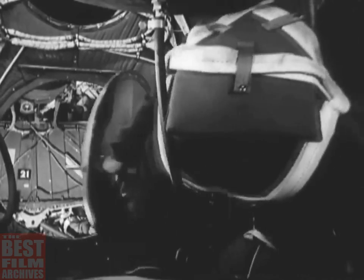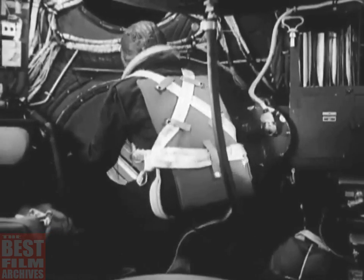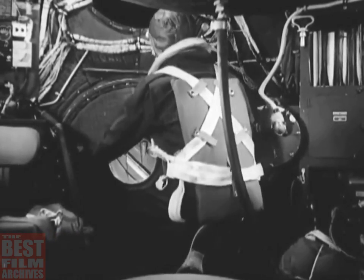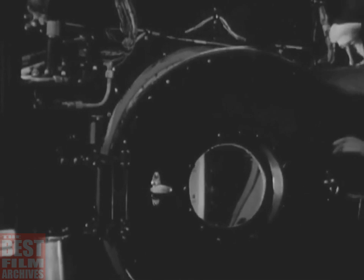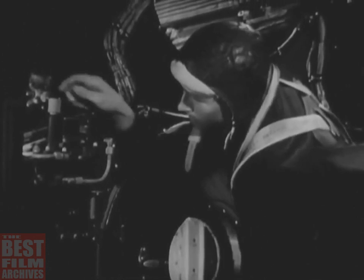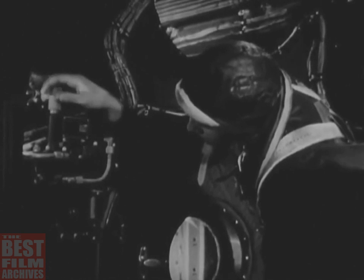As soon as the radio operator gets in, he climbs back to close the pressure door between the forward compartment and the forward bomb bay. The bombardier is the last one in, so he closes the hatch. The gunners close the pressure doors in their compartment. They also open the cabin pressure valves, which will now automatically maintain the cabin pressure at the desired level.